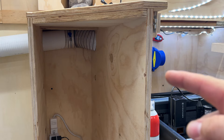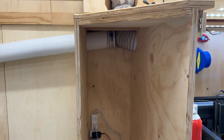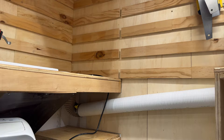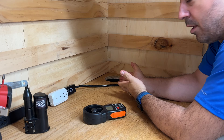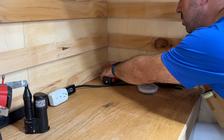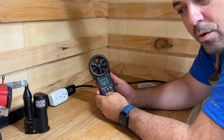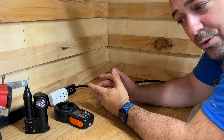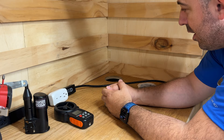I'm going to make one more blast gate over at the new enclosure. It exits the unit, goes through a short piece of flex pipe — you only want to use as little flex pipe as possible and always prefer smooth pipe. At the new enclosure's end we did another wind speed test; we were in the 900s before and now we're at 885, so we lost around 10%. That loss is due to the flex pipe — anytime you use flex pipe with ribbing it creates wind resistance that lowers suction power, same as with a dust collector.